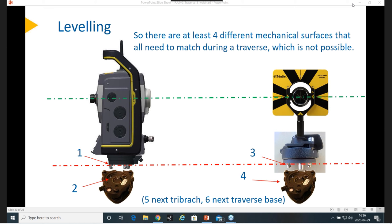In reality, if the instrument reports the compensators within range, then the leveling is sufficient for work and there's no need to keep trying to perfectly center the level bubble — is that correct? Yes. It's really accurate all the way out to when it's out of range. The compensator range is actually much, much wider outside of that as well, but we don't really want to use it to secure accuracy. It doesn't drop any accuracy even close to the range limit — it's still really, really accurate all the way out.